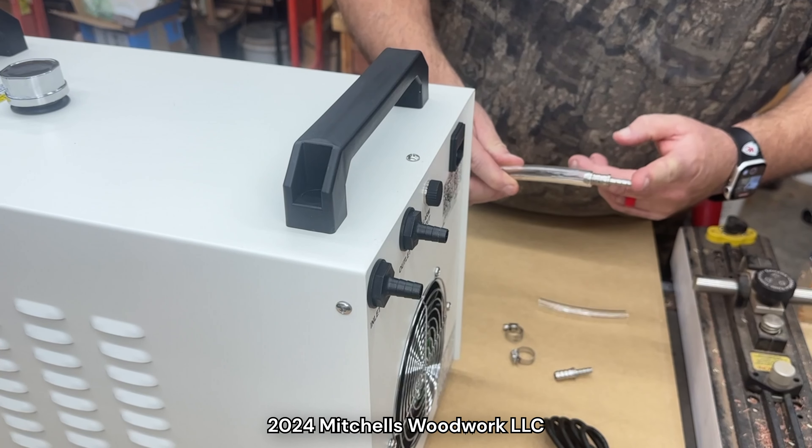I'm ready to test the cooling system, which will be turning on the Festool and seeing if it will make the chiller come on. All I've got to do is hit my coolant flood - that turns on the Festool, which should in turn turn on the chiller. The chiller's running. Festool looks good. Great water flow there. I'm going to call that a success. The only thing left to do is install this chiller alarm cable and we'll be ready to rock and roll.